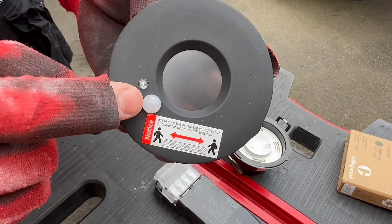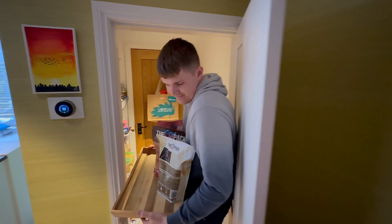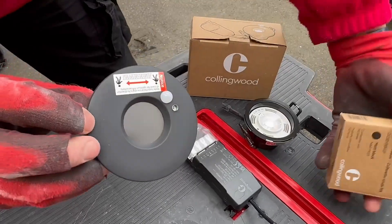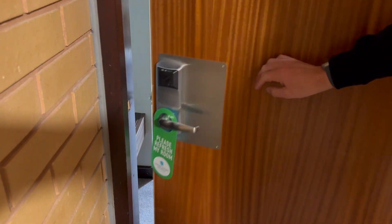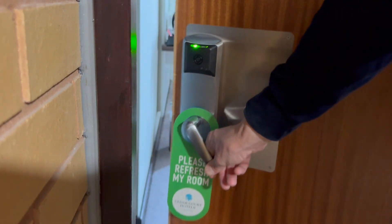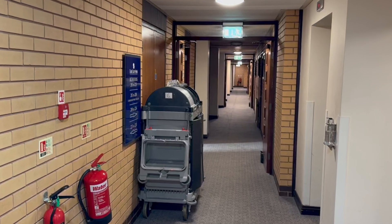The sensing on the PIR is slightly directional, and Collingwood recommends aligning the sensor with the direction of travel of people heading through the room. While adding a PIR sensor is great for energy saving, it also reduces first-fix installation costs, as you don't need to install the wiring of switch drops and back boxes for light switches. There's also an emergency option available for hotel corridors and other commercial buildings — check the link in the description. Let me know where you think you can use them.